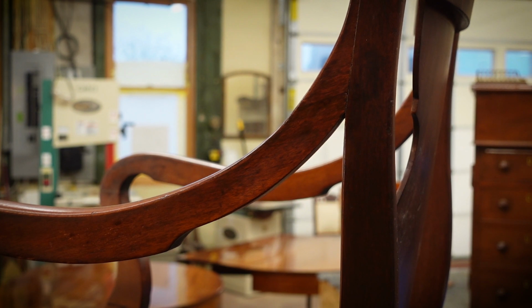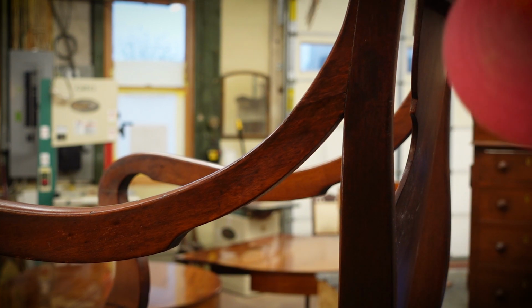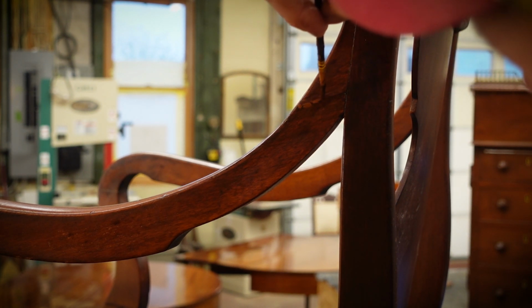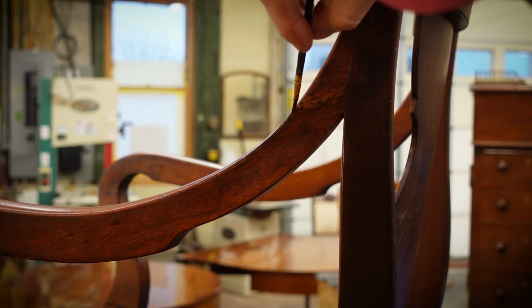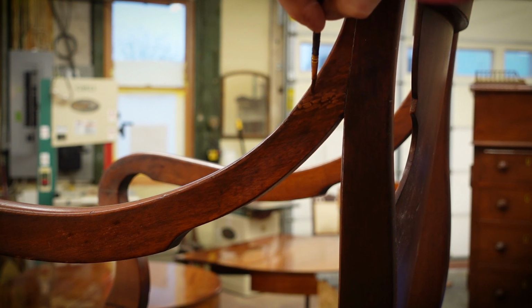And some of the tricks that I like to employ are to color over the actual breaks if you can afford to do so and make it hide. So then I'll come back over this with a lighter shade and address this crack right here. And it's best if you keep your brush strokes looking sort of like a grain pattern. You don't want to overdo it. That even seems a little aggressive, but I can tone it down in the next step.